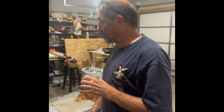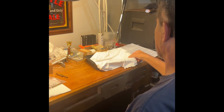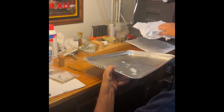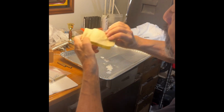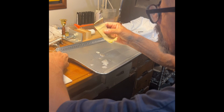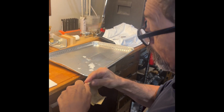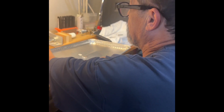With the holes drilled, come back to the workbench. Actually, it's the bench I use to put the pens together. And I'm gonna glue those little pieces of metal, the little tubes, inside the wood. And just take a piece of sandpaper, about 120 grit's good, just enough to get a scratch on the tubes themselves.